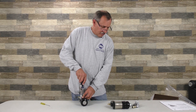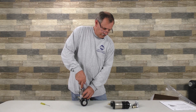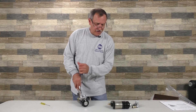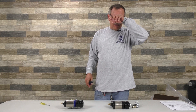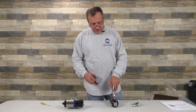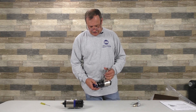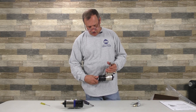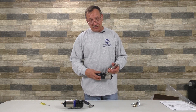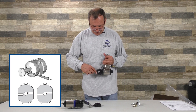You do standard regular shutdown procedures for greasing the gun for both of them. The main issues people have with the guns is they'll start having an off ratio. 99.9% of the problems when you're spraying is in the gun — it's going to be your side seal or your mixing chamber, and most of the time it's the mixing chamber. You have side ports on it — the impingement ports. When you do an overhaul or clean it, make sure those are clean. They're not supposed to line straight up — they're supposed to be at a little bit of an angle so the fluid, when it hits, swirls.